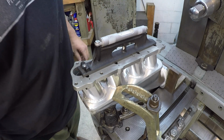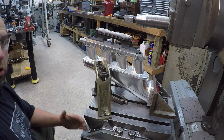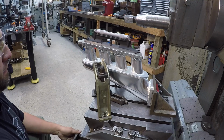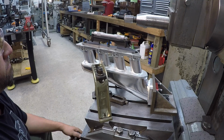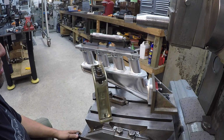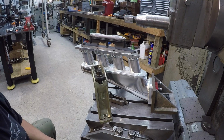All right, and then we'll start rotating the table down. Got the worm screws down here, and use this square drive out here on the end. The machine is not level, so you can only use this to kind of get you close. That's all we're doing. We're just going to use it to get our flange close, right there. So from there, we'll go ahead and start indicating.